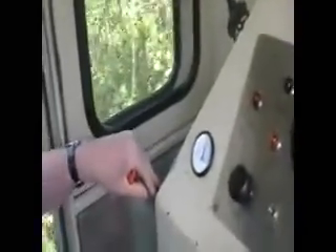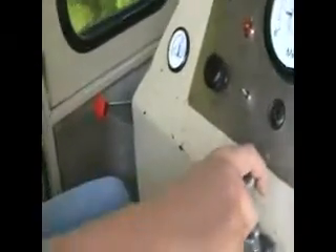This time, demonstrate the dead man's effect. He's got it in reverse at the moment so we're just reversing back. What he's going to do now is go into forward, go up, and he's going to knock it into neutral by accident. At a fair turn of speed, now knock it into neutral — here we go, and we're rolling like a good one, and we've got to stop it on the brake. No sudden stopping. And that's on the brake — we've suddenly stopped. The dead man's could be linked into that to either have the engine switched off and brakes come in, or just going to neutral. Where he's got it now it's just in tick-over speed, and it will creep like the other two, but there's plenty of play in it. He's just operating the brake to slow us down — stop it for us, Matthew. He's stopped and we've stopped.